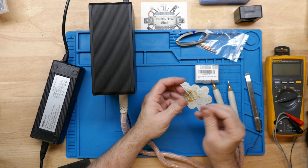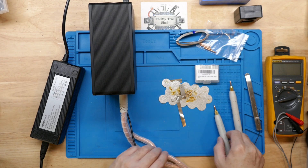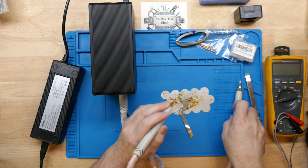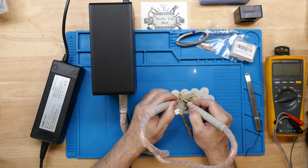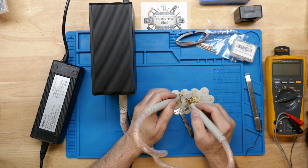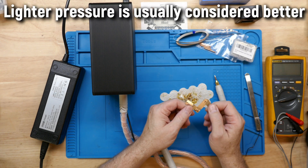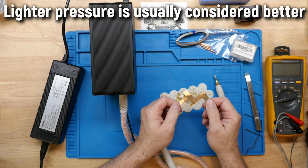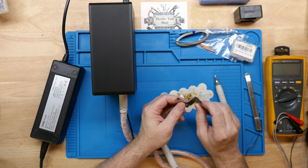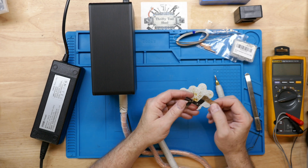I'll put this down on the floor and see how well this works. Oh, that was like a dream — I wouldn't have thought the foot switch would make that much difference. I was able to hold and position exactly like I wanted, the pressure I wanted, alignment was good, and then I had complete control. I am totally shocked at how much better control that gave me. I'm so used to the time-based ones — they work well enough, but at 2.0 that did an amazing job. Let me get another strip — that felt really, really solid. I held down really, really hard on that one to see if there was any difference, and both ways welded very, very well. No complaints with either one — super, super strong.